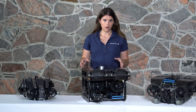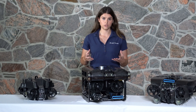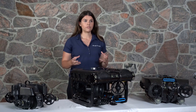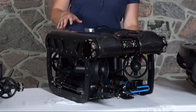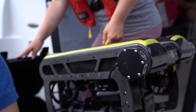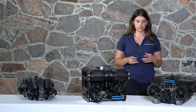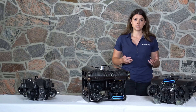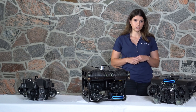The Pivot is a balance of size and power. It's a step up from the Photon ROV in terms of the tooling it can support and additional sensors. However, different to the Revolution ROV, you'll note that the camera and tooling platform are separated — typically this is a pilot preference. As larger platforms, the Pivot and Revolution have additional capabilities in terms of autonomous mission planning as well as ROV underwater positioning.